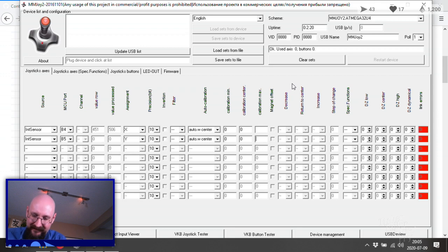You never want to have a bad pot. Usually the case. I mean, I won't say that I'm not going to convert this thing to Hall effect sensors. Friends, do we find out the problem? Or is that just the wrong orange side? That is the wrong orange. That's good. Green. Okay. So the Y. The x-axis is fine, the y-axis is just not having it right now for some reason. And we'll have to figure out why that is.